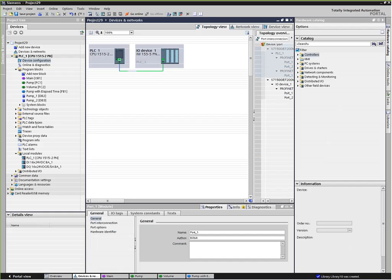One of the advantages of Profinet is that it uses the Ethernet standard TCP/IP conventions and so forth, including layer one stuff, which means that I can actually do ring topology, which is kind of nice. So if I do that double connection here, it's actually created a ring. And what Siemens has done with the TIA portal is that it actually goes out and checks, are these compatible devices with a ring architecture?